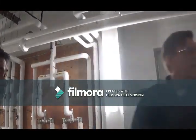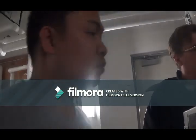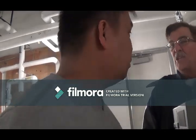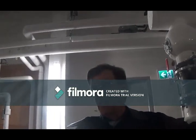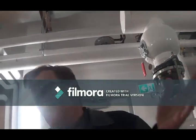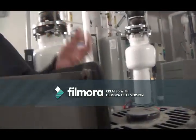That's what this is. Now, maintenance wise, if you look at these units, they have grease service. It should be done once a year, minimum. I would suggest a changeover, a repeating task, so that maintenance gets done and these things are greased. You have to check each individual pump that you own, not all of them have it. Once or twice a year. The way these ones work is you take the screw at the bottom, excess grease comes up. You don't want to put too much in there. So a minimum of once a year.